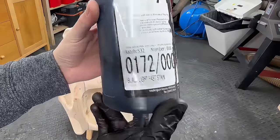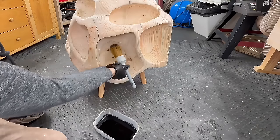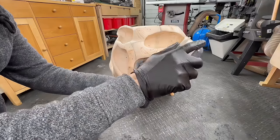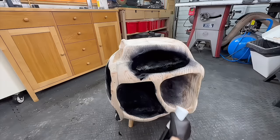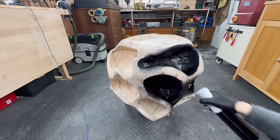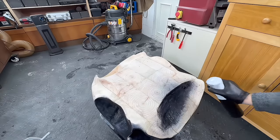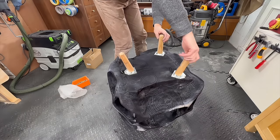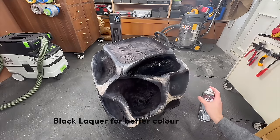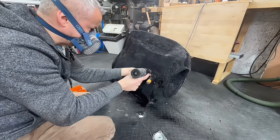Before you start typing your comments, hold your horses and just trust the process. I wanted to stain the insides of those carved-out bits black, and as you can see the brushing didn't really work so I came up with a very easy and super cheap way to spray the stain on - this spray bottle has a very fine mist and works great for this application, and I paid two pounds for it on Temu. I could have just torched them but I know most of you don't like that. Staining them black also uses dark colors to elevate the look of wood and make it look more expensive - you'll see what I mean at the end.